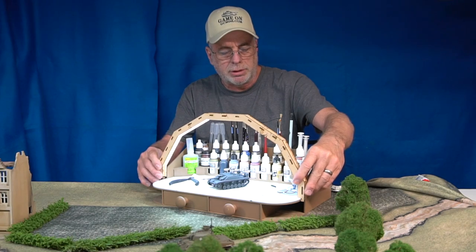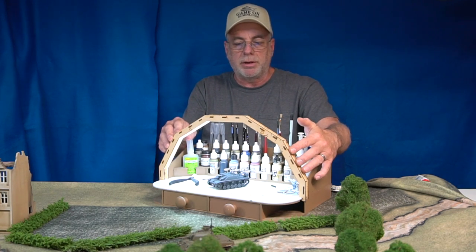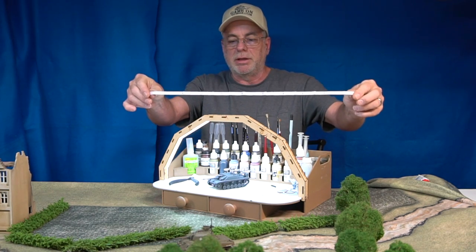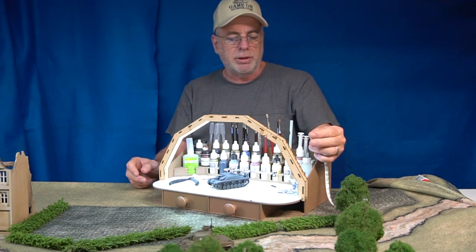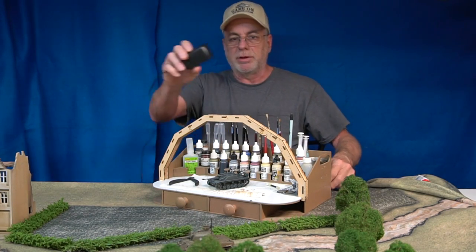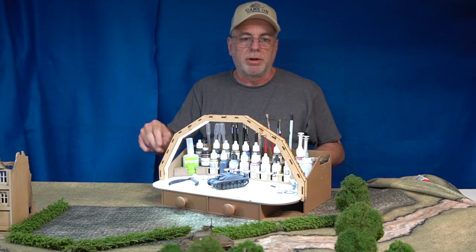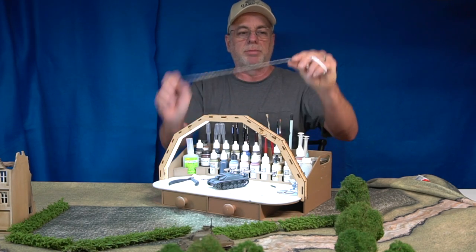So this is what I want to talk to you guys about today — this light kit. In the past, it was available in kit form and you had to put it together yourself. You had to put the light strip inside, which is basically a strip of LED lights with an adhesive back. The problem with this was that in order to do it, you had to have a 12-volt transformer, like one of these wall bricks here, and if it had a plug on the end, you had to snip the plug off, strip the wires, and then solder those wires to the end of the light strip before you assembled it.